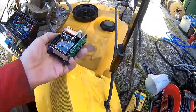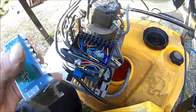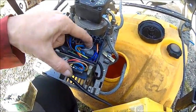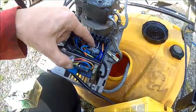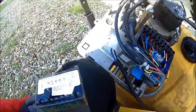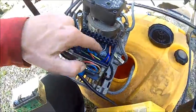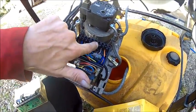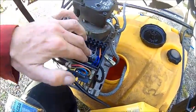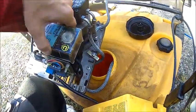After a bit of searching we found that this replacement is an 832.3, which has a different socket wiring from the 974 that was in it. So I had to rewire the socket. The problem is that the neutral is actually connected directly to the socket base, so if you use an 832.3 instead of a 974 you need a different base. I used the terminal block down there to get the neutrals off that one. Let's stick it on and pray.